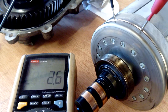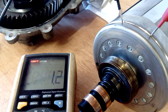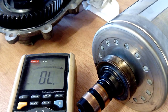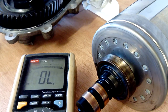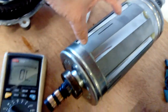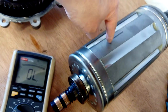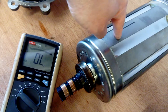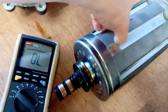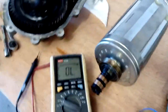You can see that the wires themselves have got a bit of resistance so there's going to be a bit of inaccuracy. But what we've got here is basically this: if the coil started there and ended there, then somewhere around about here — there is a short between the internal windings and the armature, and the splines. That's the insulation fault — that's actually what it is.